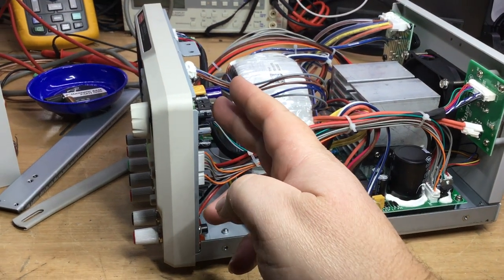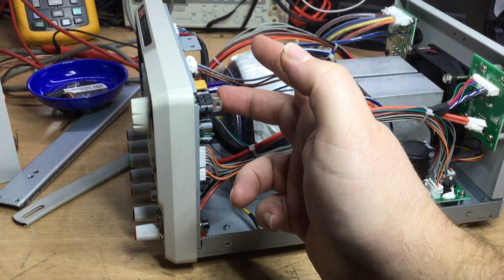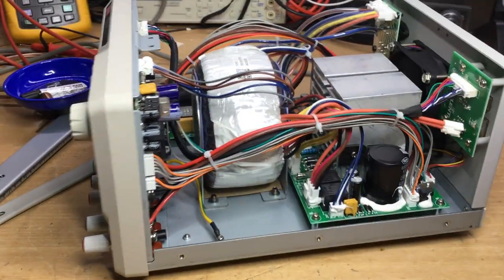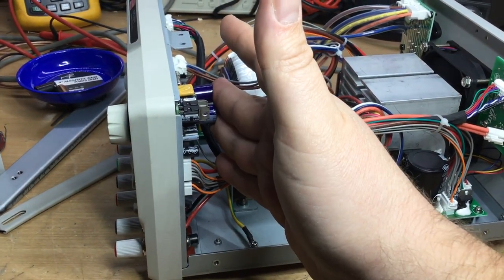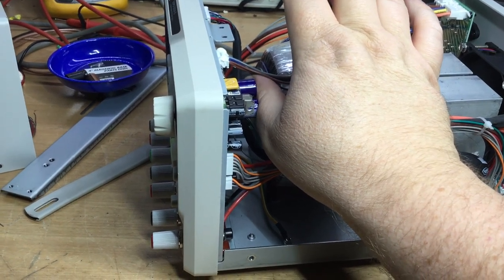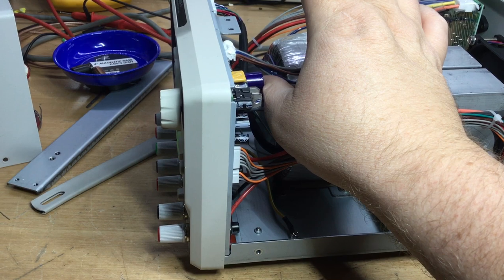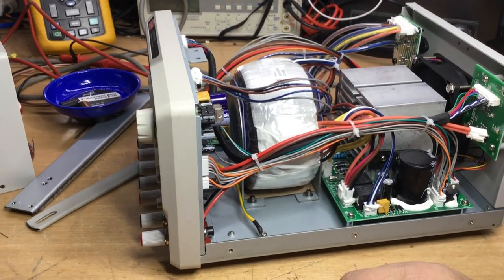These regulator ICs, that's quite warm. It's just warm, really, verging on, yeah, these are mildly warm. You can certainly feel them. Keep your fingers warm if you keep them on them. But that bridge rectifier is definitely slogging its guts out, and I can feel the warmth on those capacitors when you use a more sensitive part of your hand, the back of your fingers, on the capacitors. There's some definite warmth there being conducted through those capacitors. So I can understand why the fault happens now.